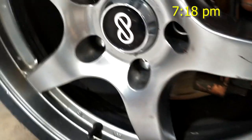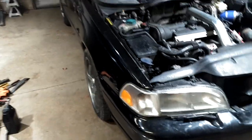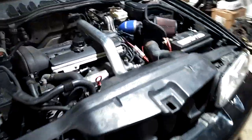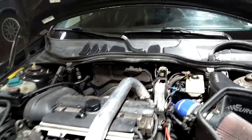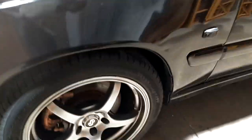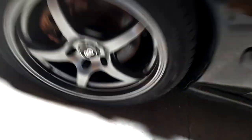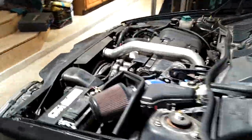When I pushed the spacer all the way on it felt loose — could be a situation with the hub — so I brought it back out to that beveled edge where it feels nice and tight. Set the wheel on there and put the lug nuts in. The lug nuts were kind of something else to torque on — ran them down by hand and had to go another three or four turns; they're just off a little bit. Everything's together and hooked up. Going to open the garage, fire it up, and take it for a cruise after Dan moves his car — then we'll have a celebratory bottle of water or some tea.